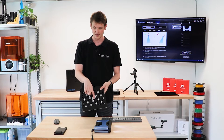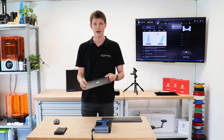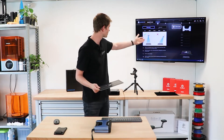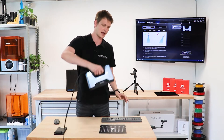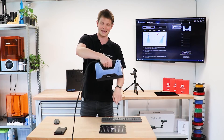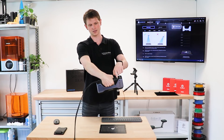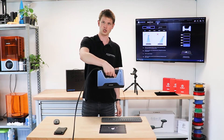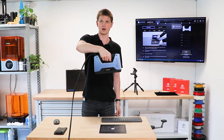There are bigger white dots which are important for orienting the calibration plate properly. Right now it tells us on the screen to put it down flat on the table, take the scanner, and there is a little light cross projected by the scanner onto the plate. That cross is supposed to be in the center. To start the calibration process there is a play button on the back, and then I just need to hold it at different heights as the green bars on my screen fill up.